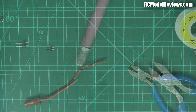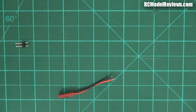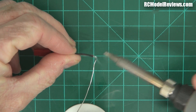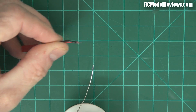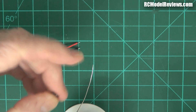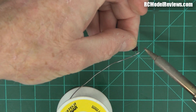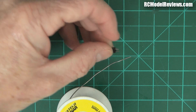I've stripped back the insulation using my knife because the side cutters weren't doing it. Now I get my solder out and tin the ends. If you don't know how to solder, I put a tutorial on this channel some time ago - go watch that. You want plenty of fresh solder; it has to be fresh otherwise it just won't solder. Then we take our pin headers and tin those as well - the essential part of soldering is making sure everything is loaded up with fresh solder.